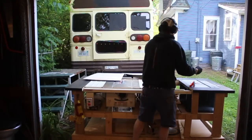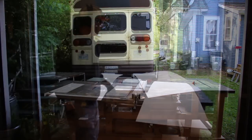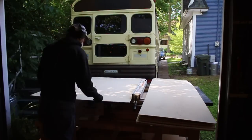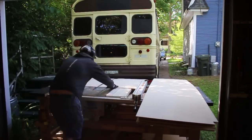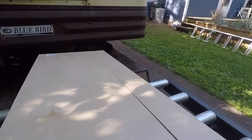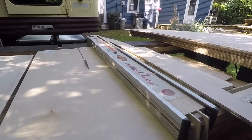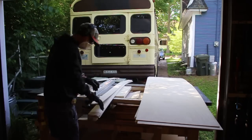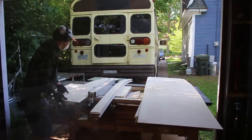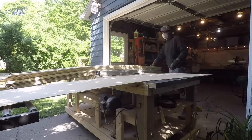Cutting the planks is a big part of this job. I halved the sheets of plywood first just to make them more manageable, and then calculated the width I wanted for each plank. For me, that ended up being just under four inches wide. I've seen other people do wider boards, which also has a good look, but I went with narrower planks for the way my space looks. I did this on my table saw. You could also use a circular saw with a cutting guide. I used a fine-toothed blade on the table saw, which had very little tear-out and I would highly recommend.